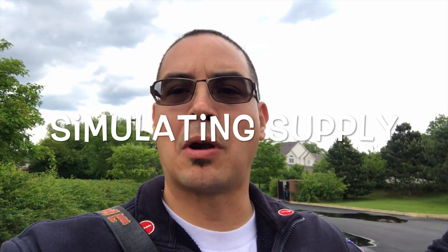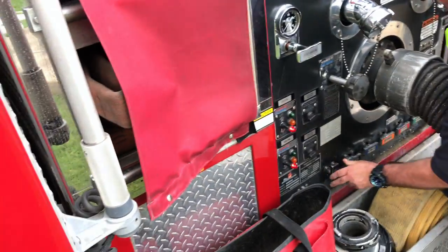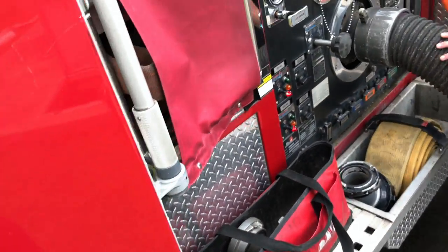Now we're going to simulate a tender feeding the engine. We had some problems with the previous operation, so the hydrant is going to act as the tender. We're going to simulate flowing a nozzle off the engine — that's your supply line to the primary attack engine. Remember, you're going to be water supply to that primary attack, whether you're right next to him or 300 feet down the road, like what we do at the drill spot. Firefighter Patel is going to open up his intake — the supply side from the tender.